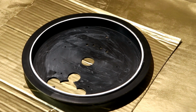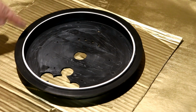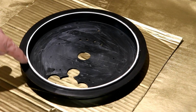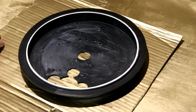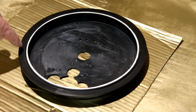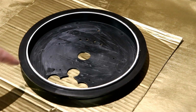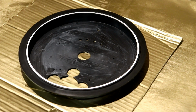Cool. Right, dear friends, as I'm about to start assembling this, what I realised originally is that it looks much nicer if the brass carries on from all around the outside, then you get the glass, and then the brass goes around whatever this part's called, rather than having black plastic. What I did find though was if I painted it with the little rebate painted as well, when I put the circular glass window in, it would scratch little bits of paint off around this little rebate, which could then regularly fall in. You get the whole thing together, really pleased, and then you look at it and find there are a load of little flakes of paint. So I've used a bit of this engraving laminate, just cut, that I've pushed into there. I've hoovered it. So let's do some painting.